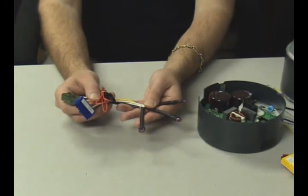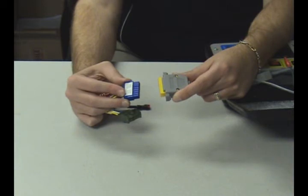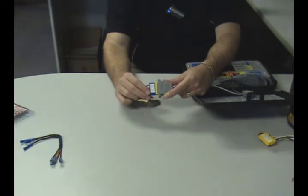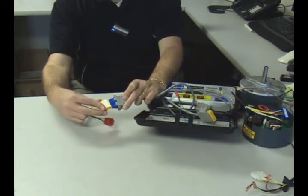The matching female quick disconnect terminals on the blue-green harness should now be connected to the male tabs on the circuit board. Now gently connect the blue connector of the blue-green adapter to the yellow connector on your VZ7. Be very careful when plugging in these 16-pin connectors — the pins inside are fragile and can be easily damaged if forced. Roll them back and forth to seat them rather than pushing with any force. Replacement harnesses are available for the VZ7 if you don't heed this advice. Zebra Instruments didn't choose this connector type; we have to use it to mate with the standard input-output connections on furnace and air handler ECM motors. Now the yellow connector on the red-yellow adapter should be carefully plugged into the blue connector of your VZ7.